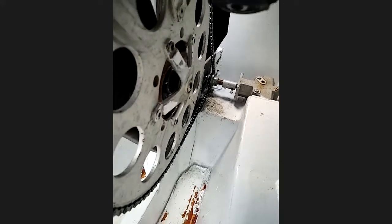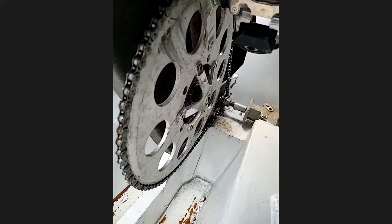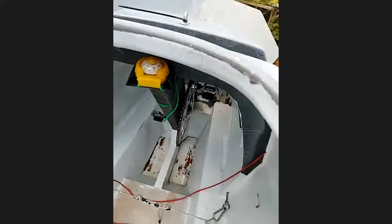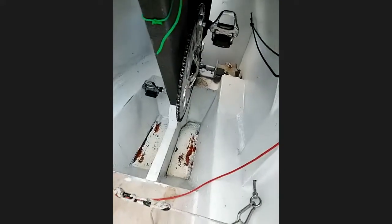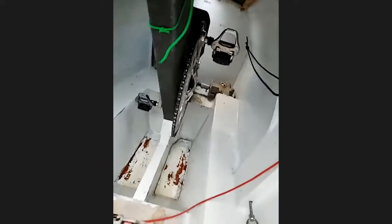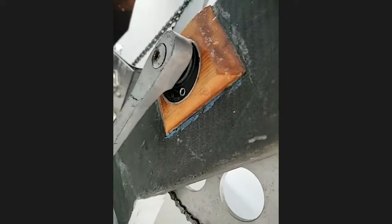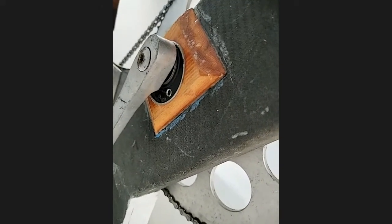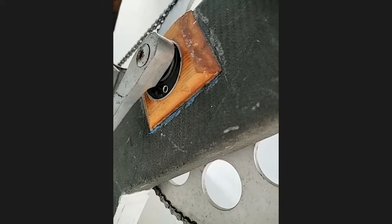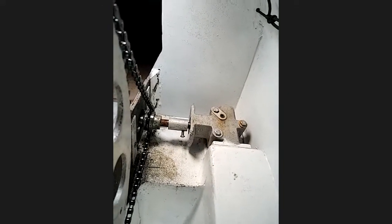The chain drive drives the cog on this miter pack gearbox — it's a one-to-one gearbox. Another thing I put in this last build is an eccentric bottom bracket so I can adjust the chain tension without needing an idler. That keeps the system more efficient and quieter. The eccentric bottom bracket lets you undo a bolt on one side and change its position to adjust the chain tension.